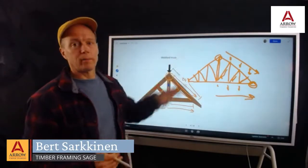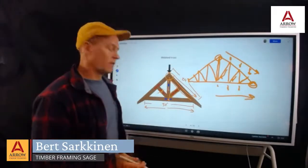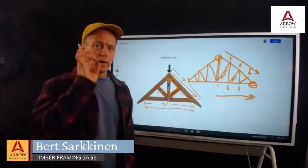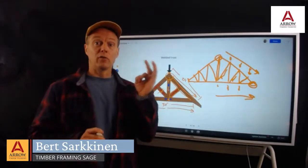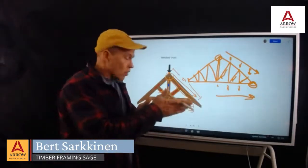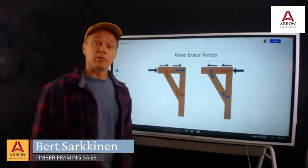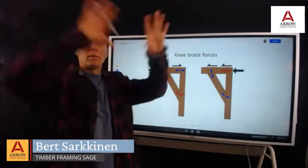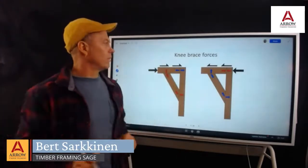That's a good concept to know, that tension, the strength of how much that's going to withstand. And just for your information, a white oak peg 1¼ thick is equal to a 1/2 inch mild steel bolt. And that is also calculated in its shear force. So it's great stuff. The whole concept of a truss and the shear force of little connectors that can make big spans. That's how bridges work. That's how it's all over the building industry.